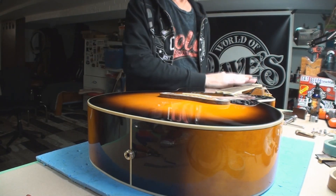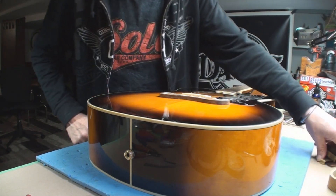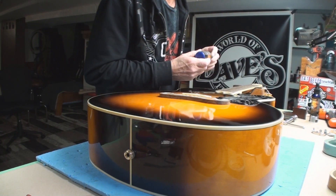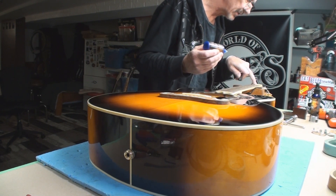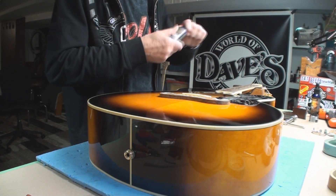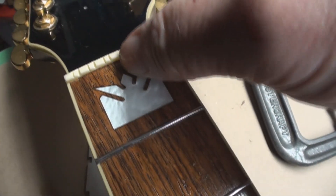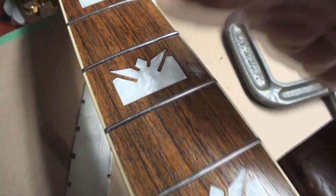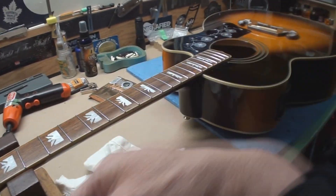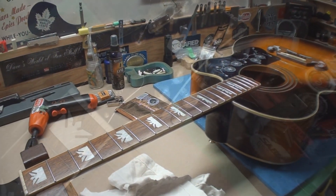The other thing is, if I put too much back bow in it, well, it's got a two-way truss rod — two directions. This has got to be the most anemic-looking rosewood, if it even is rosewood. It's so dry it's almost starting to split where some of the inlays have been put in. Give me a minute or two. I'm just letting the linseed oil drink up — you can see it's starting to crack along there, cracking along there. She dried up pretty good. Usually when I put oil on a fingerboard I put it on, wipe it in, wipe it off — there was no time to wipe it off. It drank all of it. Two passes.